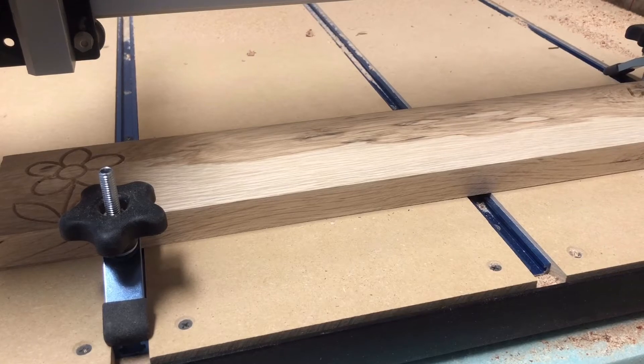We did a bit change — we changed out the V-carve bit and went to a 1/8 inch end mill for the outline of the name. I'm going to stick around just long enough to make sure it doesn't get into the clamps, then go eat supper and come back to check on it. If everything looks good, we'll move on to cutting out the name pockets.